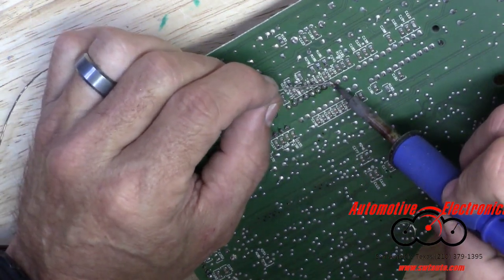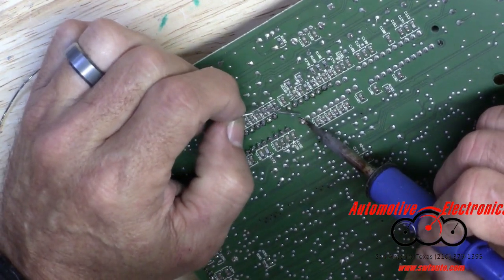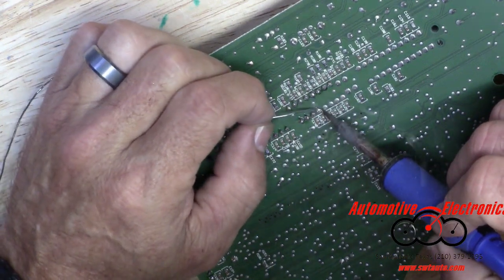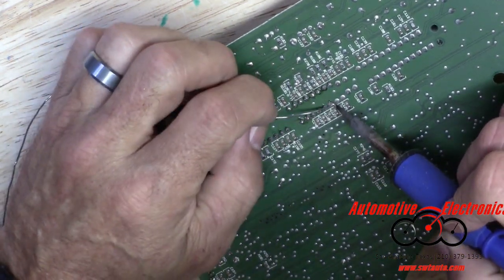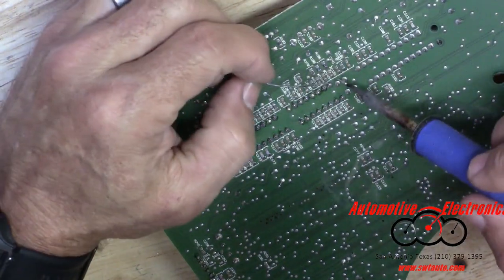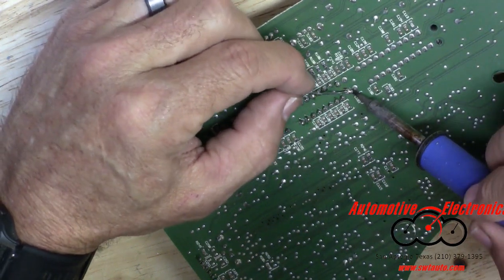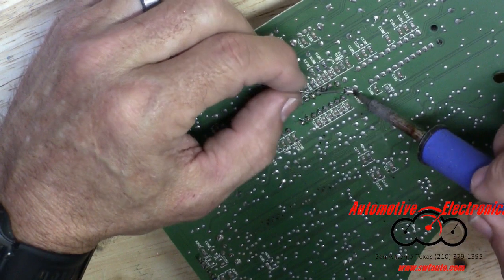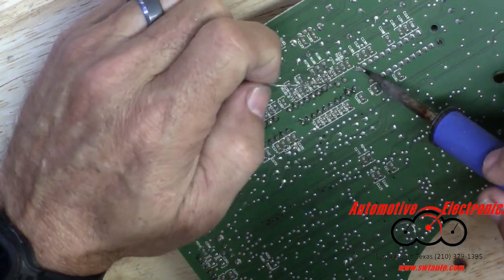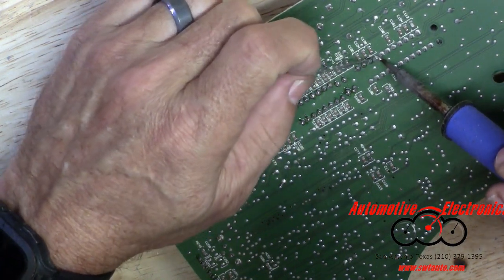There are definitely some tricks to soldering. This has a flux core solder, so it has the flux you need inside the core of the solder, and you can just depend on that if you work quick enough. The longer you spend on it, the more you need additional flux, because that's what flux does, it gives you more work time. More work time accomplishes a lot of things.